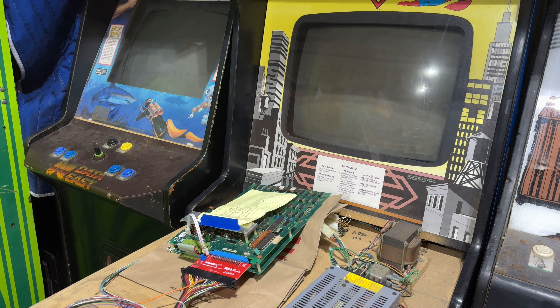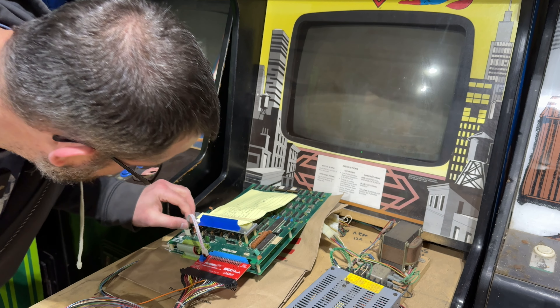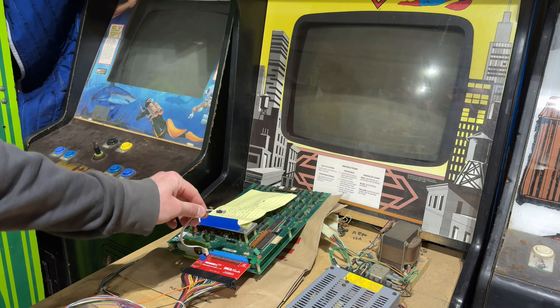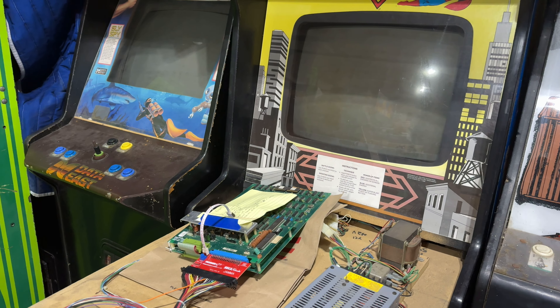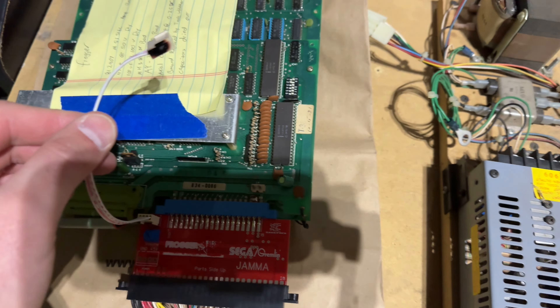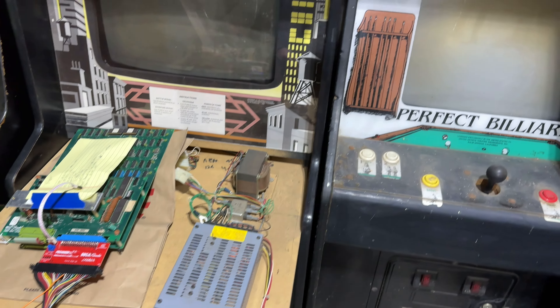This board's not so good. It smells kind of bad. Let me look at it — it's right by the audio. Is that a tantalum cap? 6.8 microfarad, 16 volts. I've heard that could happen before. It got the — look at that! Can you see that on camera? Let me take you off the tripod and show you this. It burned up the side of the adapter here, but that pin is not populated so I think it just melted a little bit of the plastic.